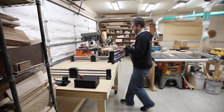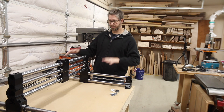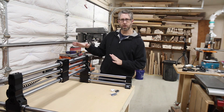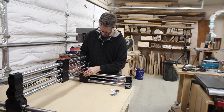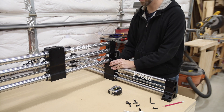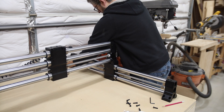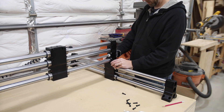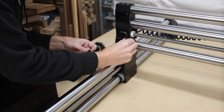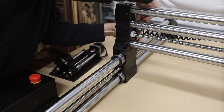I've got all the pieces up here. We're going to use the X rail to square up the whole machine — it's just sitting on there right now, so I'm going to square it up visually and put some bolts in so it's bolted to the Y rails. I used a tape measure to make sure the right-hand Y rail was spaced evenly from the edge of the table front to back. There's an indent where the X rail sits into the Y rail, so I flush it up on one end before putting in bolts, then did the same on the other side.